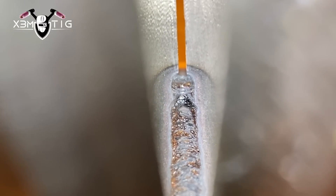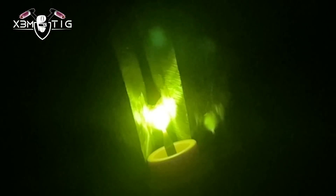Okay, this is the bottom section — it's already done. This is the root. I like a bigger, heavier root, especially at the bottom section, to prevent any suck-back. I like to run hot pass really hot. Same thing — grind stop starts. This joint is gonna be X-rayed so I'm just gonna pay a little bit more attention to it, be a little more careful. I'm gonna switch to dipping technique as on this side I had a little bit of high-low.